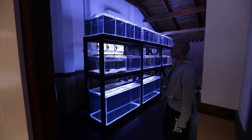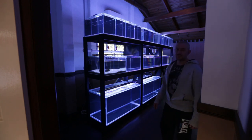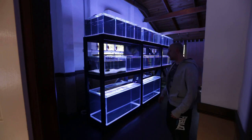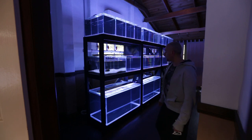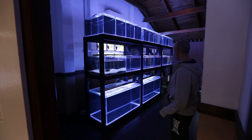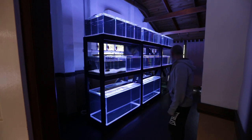I want to run this room for years. I'm not going to be relying on some sort of putty or some quick fix to fix it and, you know, just move on. It's not the right thing to do, so I cut that plumbing out and redid it. It took me a few days to do it because I was really taking my time on letting that PVC cement cure. But it's obviously paid off because now there are no leaks in this PVC. No leaks in this plumbing. I don't want to jinx it, touch wood, it's working fine.